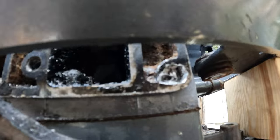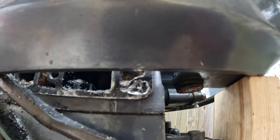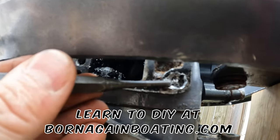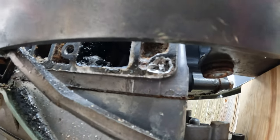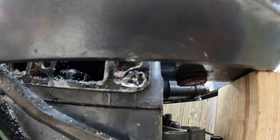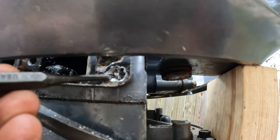This is where we are at — this is absolutely catastrophic. Definitely going to be a job for some JB Weld. I can see right here there's a little crack, so it's starting to separate. I'm getting it to move over so I'm almost to where I can get this to pop over into this gap and be able to pull it out. We're going to be able to get this thing out of here, but we're going to have to smooth all this down, fill it with JB Weld, and then re-drill it and put an insert in here — or hopefully I've got enough in the back to where I can drill and get a bolt to stick.